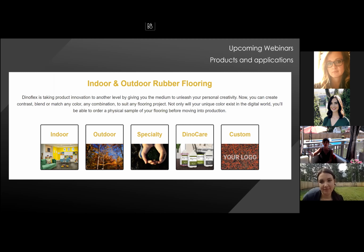However, when you do repair a rolled good, you're always going to see that cutout portion. Now, when it comes to color matching, you're always going to get a little bit of UV degradation over time. However, the new tile that you put in, as long as it's from attic stock, will eventually blend in as well. Now, if you have to make new product, you may get a dye lot issue because, depending on how long ago it was manufactured, we may not have the same dye lot available, but it will be extremely close.